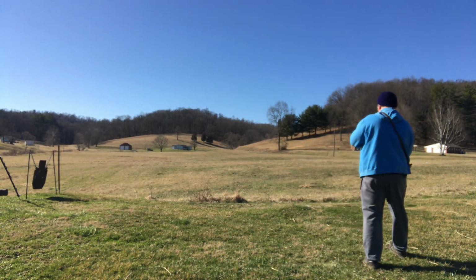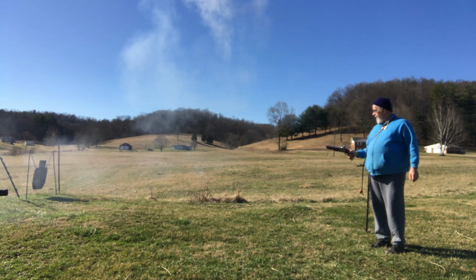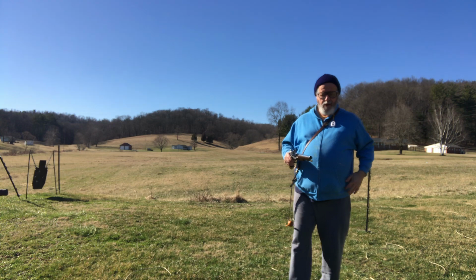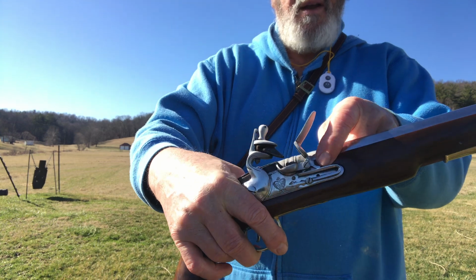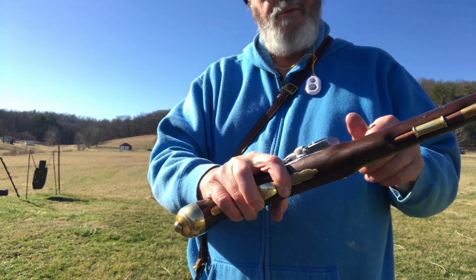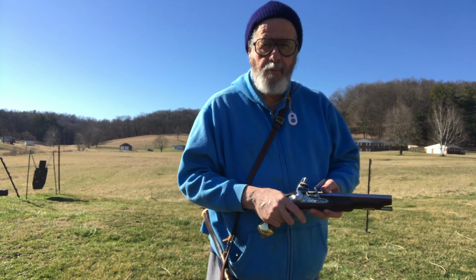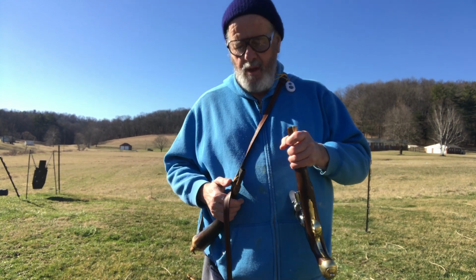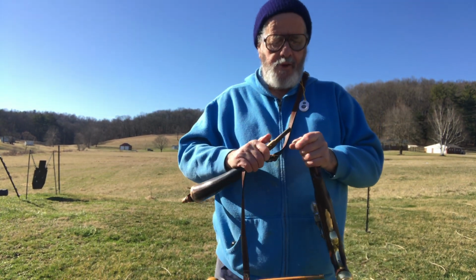She's 2 for 2. I don't even know where that went. Yeah, I don't know. That's 3 for 3. And all we did was we went and smoothed up the bottom of the frizzen right there a little bit. And if you look, you'll see where your frizzen will start, your chrome poly spring, you'll see it starting to dig into the chrome poly spring a little bit if it's a little sharp on the edge. So you don't want that to happen. That's for sure.